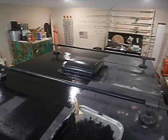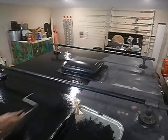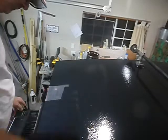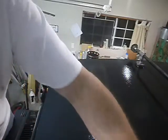You can see how it's laying out real nice. I just use a cheap foam roller here — that way no fibers are going to come out. Either that or you can use an expensive lamb's wool roller — those are about $20. That's what we use for many houses, and they last forever. For a homeowner they'll probably last you 20 years if you clean it properly. Contractors know those cheaper roller covers are not going to last too long — if you're going through $5,000 worth of paint a month, that's burning through a lot of roller covers.